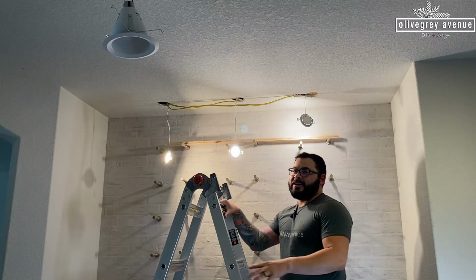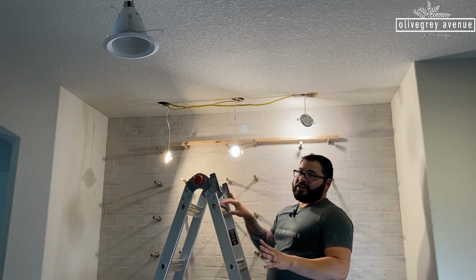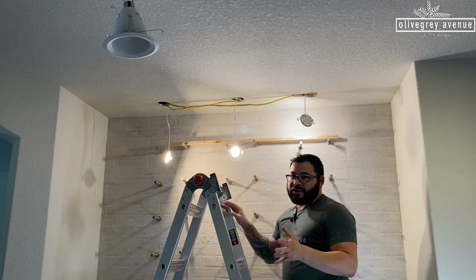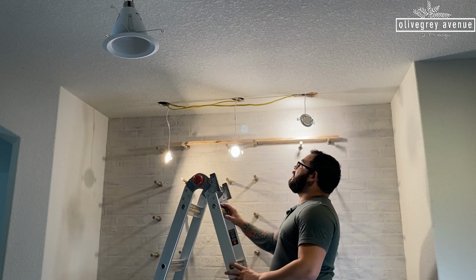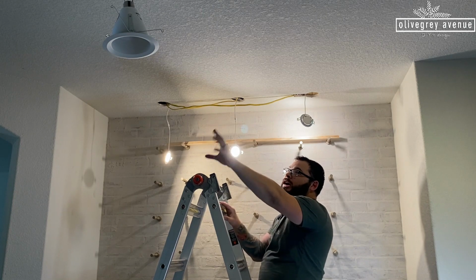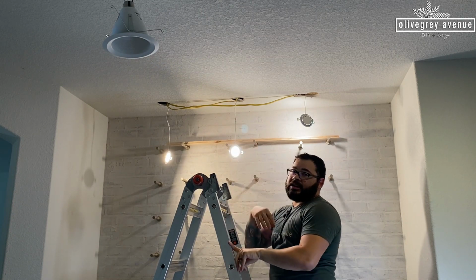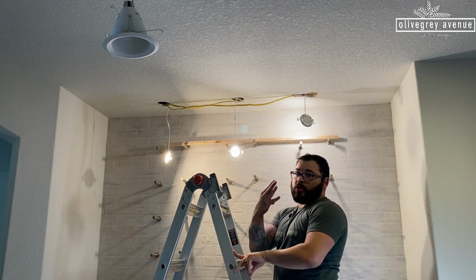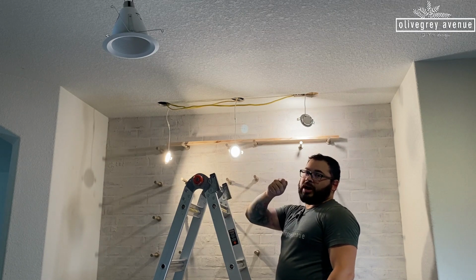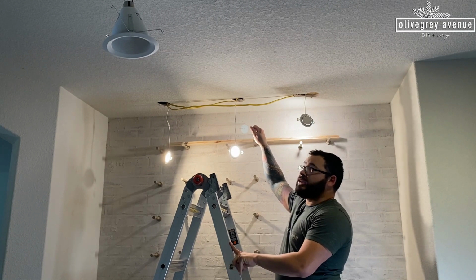All right, so we got the lighting and wiring and all that stuff done. It looks kind of really ugly right now. Well, I'm just okay with it, but it looks like we're living in a decrepit house or something like that. Wires everywhere. But we ran the wiring from this halo light, pulled down that can, got into those wirings. It had a set of Wago connectors that are for 4 wires, so it easily allowed for a new wire lead to come in, plug into that Wago, and continue the circuit this way.